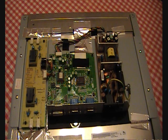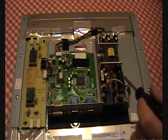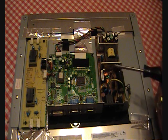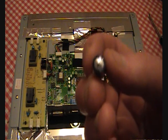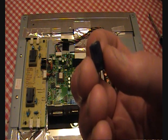This is the back of the actual PC monitor. This is the power supply unit. We're looking for bulged capacitors. I'll give an example of what I've found in this one — I've taken it out already. It's this one here. You can see the top has blown. It's had a power surge sometime along its life and it's bulged the top off.